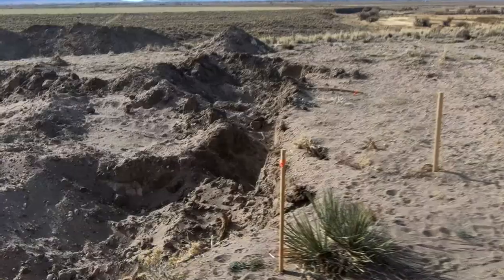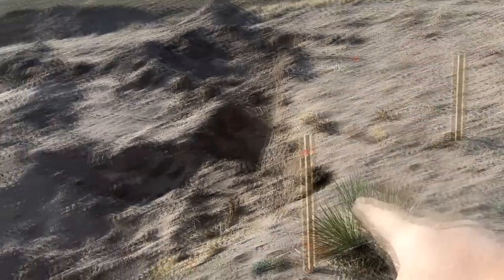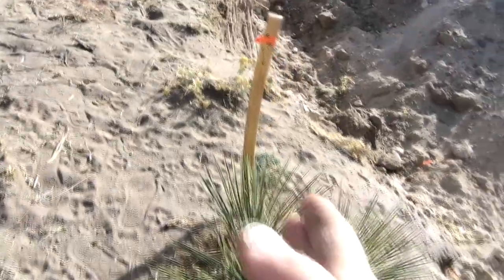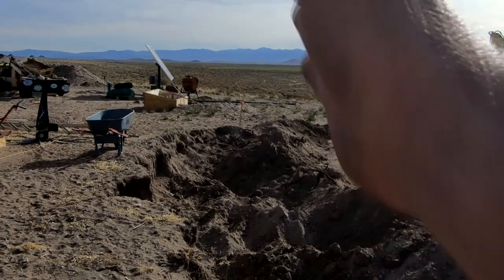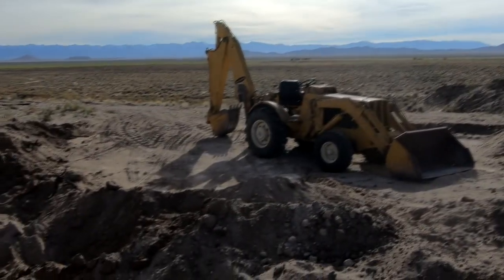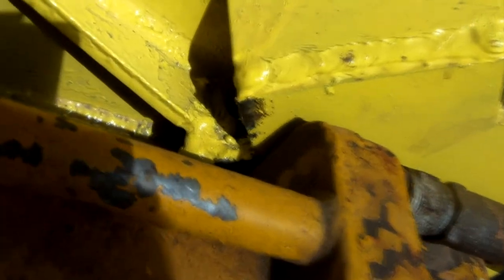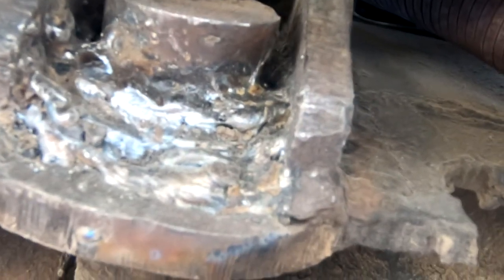Good morning — working on the cut. You can see this is the line; I'm going to cut back a little more so I have some backfill area when I put the gabion wall in. Here's the cut for the house pad, and you can see I started cutting back further. These three stakes are all lined up — I'll continue cutting down this way into the hill. Just checking out Dyna this morning after finishing her repair yesterday. The action on the ram looks like it rubs against that hanger just a little bit, but no cracks in the welds — seems to be performing okay. On the side where I did the repair, that weld had cracked so I put a new bead of welding in and painted it.